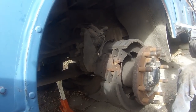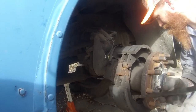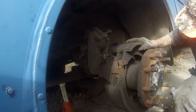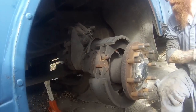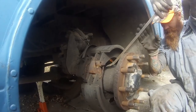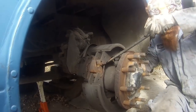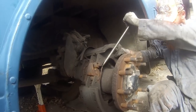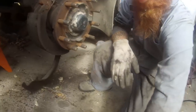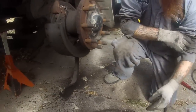This is not a normal setup — most air brakes don't have that little spacer in there. Normally the main spring goes all the way across, so it's not going to cause any issues. This looks like it's actually connected directly behind the s-cam. That's where your spring connects — there's a little pin that goes across. We'll show you on the next ones when we put them together.